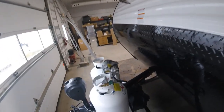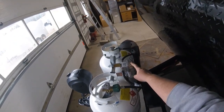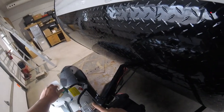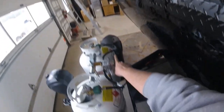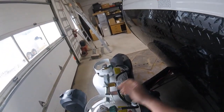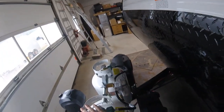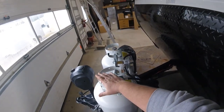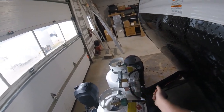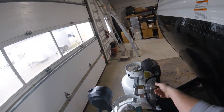Behind that you have your propane system — two 30-pound tanks. In the center is a crossover regulator, so the system is designed to be used with both bottles open. Whichever bottle the arm is pointing towards is the one it's drawing propane from. When that bottle becomes empty, the sight gauge on the front turns red but automatically starts drawing from the second tank. When you notice the sight gauge is red, turn the arm over to the other one and the gauge will go clear. Then you can take off the empty bottle and have it filled.